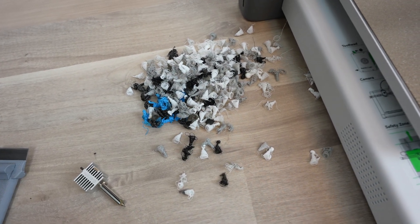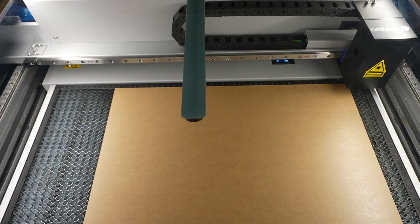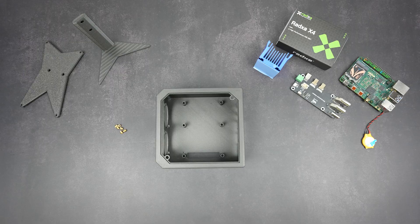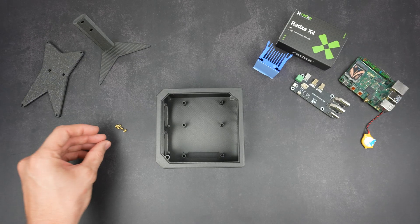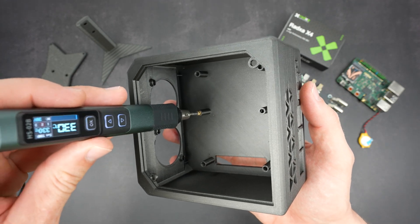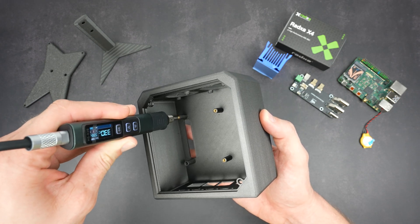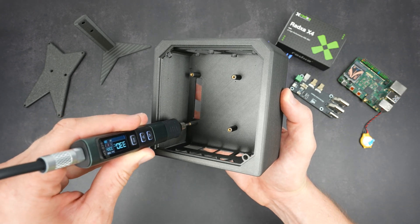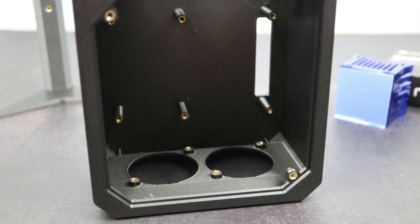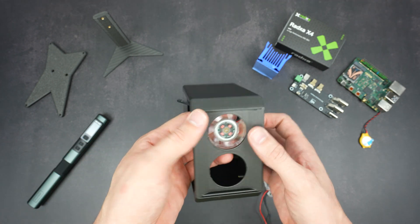Multi-colour printing does produce quite a lot of waste, but if you're smart about layout and print order you can minimise it quite a lot. Next, we need to cut the clear components — all laser cut from a sheet of 2mm clear acrylic. Now let's get the computer assembled. We start by installing brass inserts into the body of the case, melted in with a soldering iron: M2.5 brass inserts for the X4 and adapter, and M3 inserts for the two fans. The fans are secured to the front of the case with two M3×8mm button head screws each from the inside.